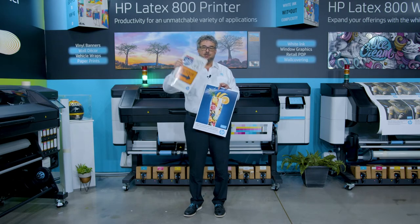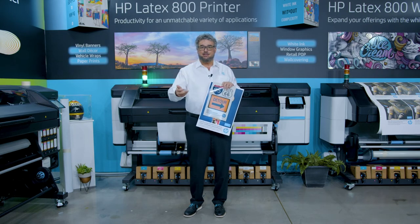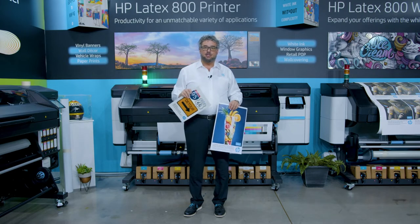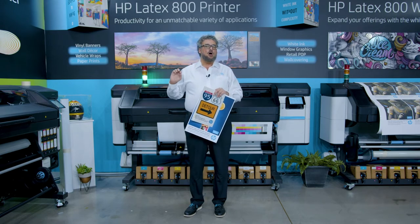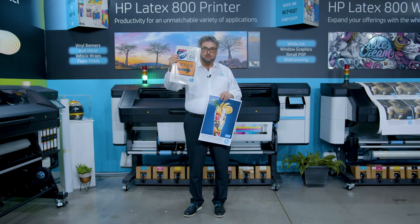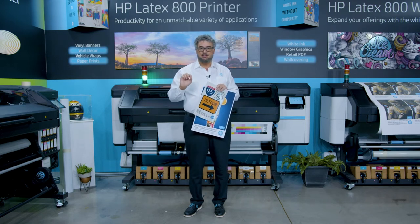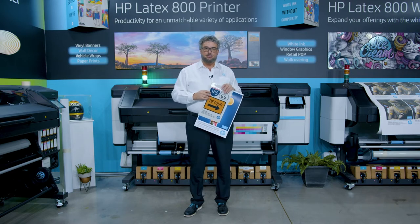However, this high-intensity prismatic — I'm going to have to laminate that. It always gets laminated. It has its own laminate system, so when you buy the high-intensity film, you also usually buy a roll of laminate with it. This is going to be outdoor for a long period of time. Now, this printed beautifully on the latex printer, but I forgot to turn the Overcoat off. You want to turn the Overcoat off when you know you're going to laminate, because that's going to give us the most effective bond between the laminate and the actual surface. Overcoat is modular ink — you can either have the anti-scratch built in, or you can say, I have a film or liquid-based laminate and I no longer need an Overcoat. Anything that has its own top coat protective bond, turn the Overcoat off.